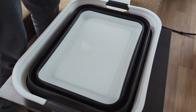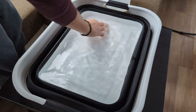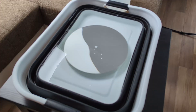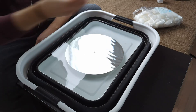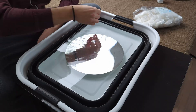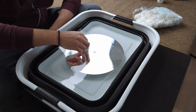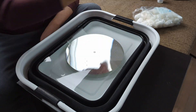After removing the support brackets, take the mirror out of the cell and place it face up on a soft towel. Avoid touching the reflective surface with your fingers, as fingerprints will be harder to remove afterwards. Move over to the tub with lukewarm water, add a drop of dish soap and a splash of isopropyl alcohol, and stir to mix. Then bring in the mirror and gently lower it until the water washes over it. Let the mirror soak for a few minutes.